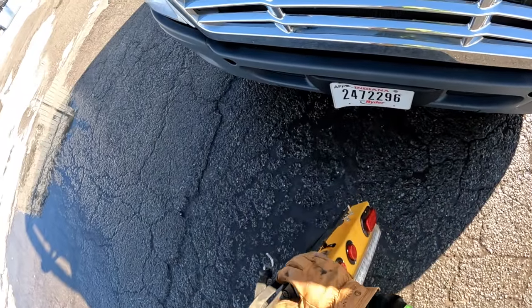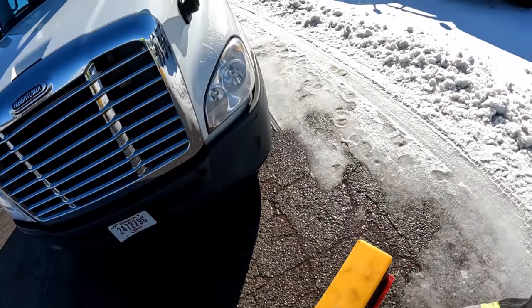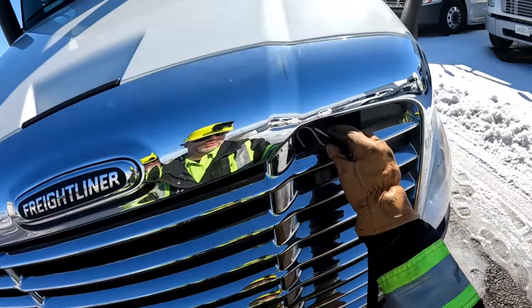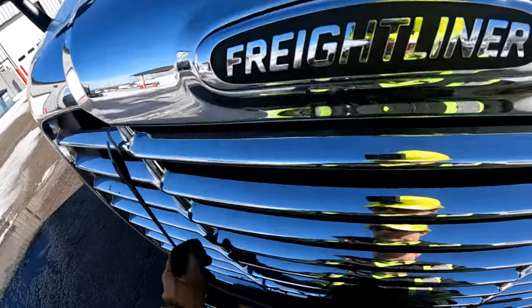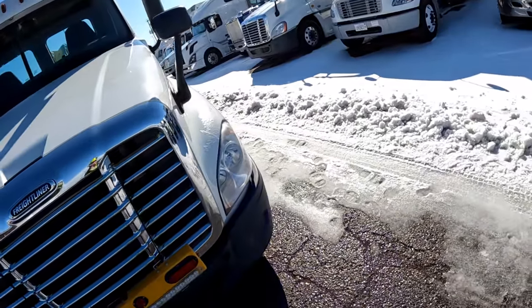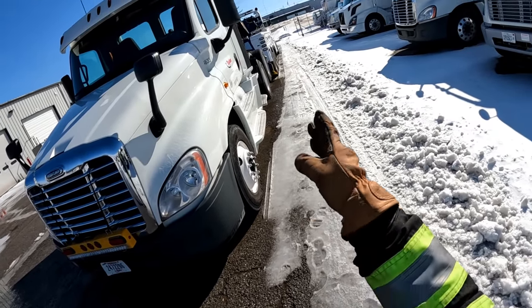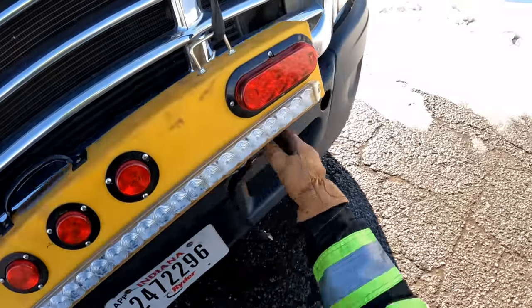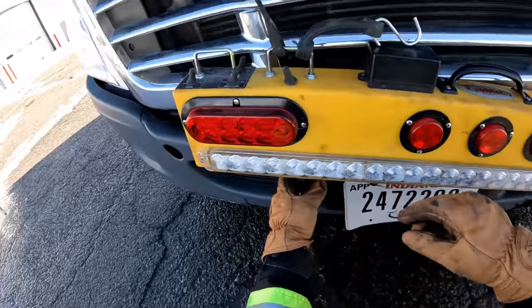Also, a lot of people ask, why do we not release the parking brakes whenever we're doing a rear tow? Several reasons. First of all, at least in the US, most steer axles, front axles, which is what is on the ground currently, do not have parking brakes. They roll freely, even when the parking brake is set. Number two, if you leave the parking brake set, and you should, heaven forbid, have a breakaway situation, the parking brakes are applied on this truck and it's going to come to a much quicker stop. Hope and pray that nothing like that ever happens, but that is my reasoning anyway.